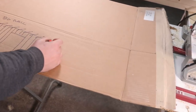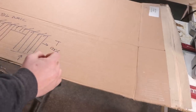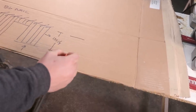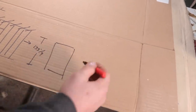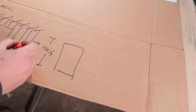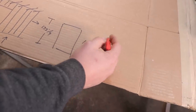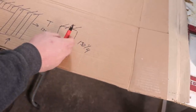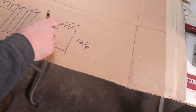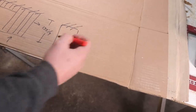Now that we have the short wall done, the big wall is 133 and a quarter inches total overall. There's going to be plates on the top and the bottom, so that'll be three extra inches because of the thickness of material. We're going to cut all of our studs in between to 130 and a quarter inches. I will then plate the tops of them after they're inserted — that way I don't have to worry about having everything level and I can just make batch cuts for everything, keeping it nice, simple, and going pretty quick.